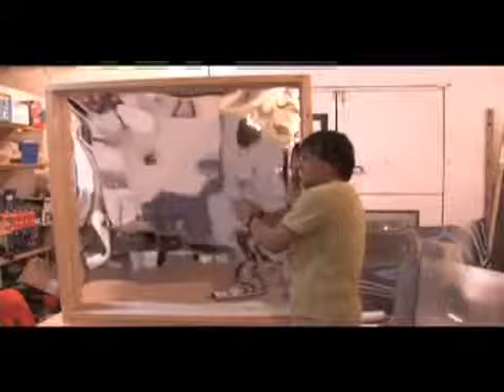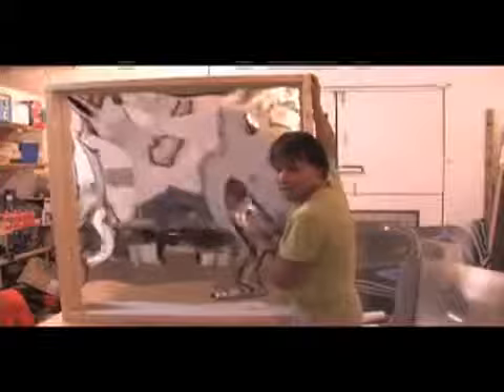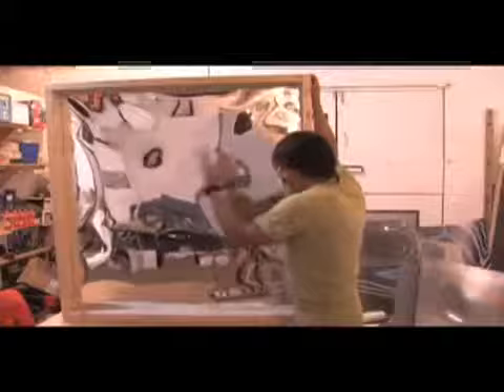This is a 90-some percent mirror — it's actually a really good mirror. This is the Part C material again, just a whole sheet of it. I've got the mastic tape — I've got this stuff on our website if you're interested. We're going to be sealing this up, drawing a vacuum in here, and I'm going to show you how you can make an adjustable parabolic mirror for about 50 bucks.